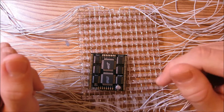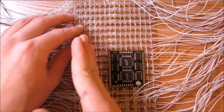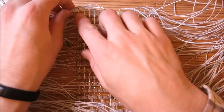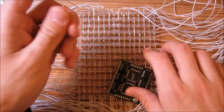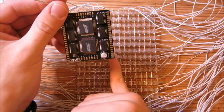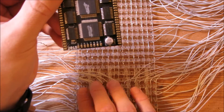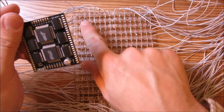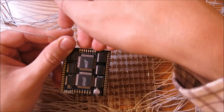Follow the diagram as I go. The matrix is oriented with LEDs pointing down. I'm calling the left and right sides accordingly. The left wire connecting to the LEDs goes to pad A. We go A through H for the top section, then I through P for the bottom. I'm going to go ahead and connect A to A, B to B, C to C, and so on, soldering all the wires directly to these pads.